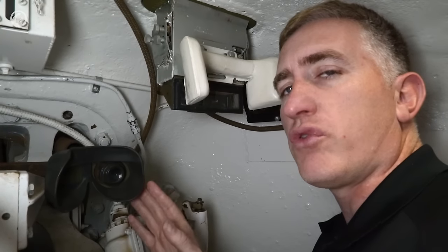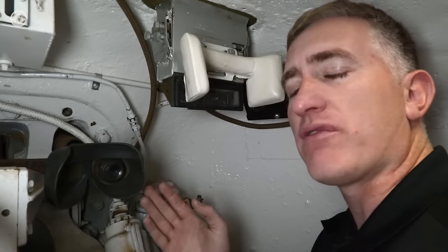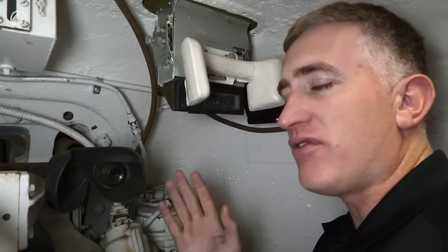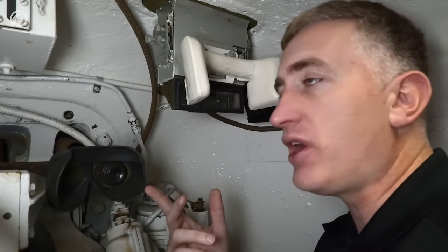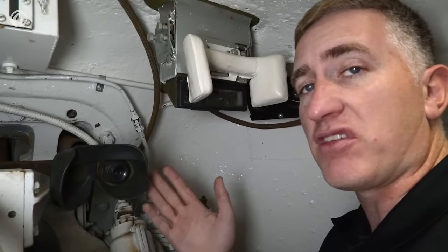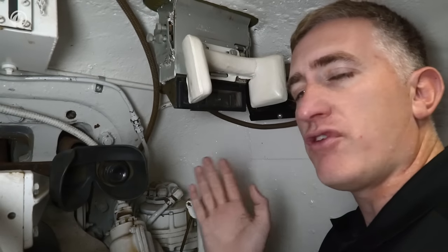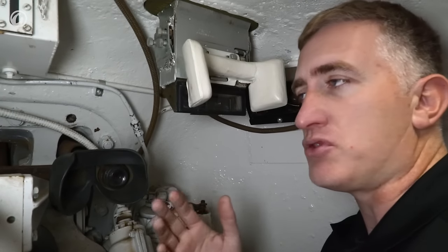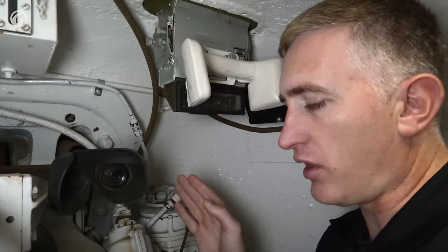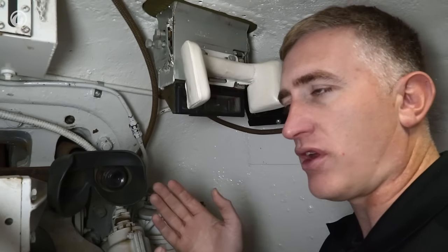However, there were a couple of problems. The linkages between the periscope and the gun — unfortunately removed on this tank — weren't the most reliable, and it took a while for a field modification to come out that actually kept the sights aligned. In the long run, the solution was to install a direct vision scope as well. Originally the M55 — not well received — they updated it to the M70F. This gave additional capability: firstly it was a x3 optic instead of the x1.4, so arguably this would have become the primary sight de facto.